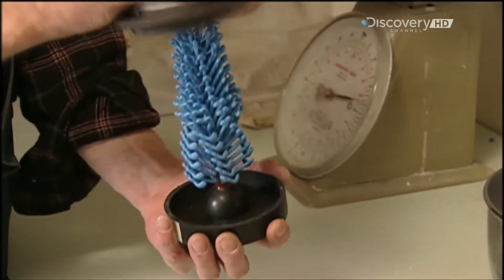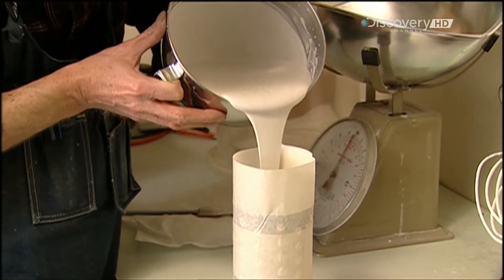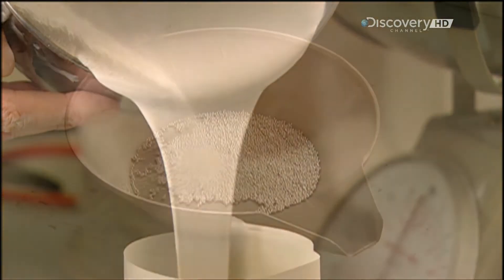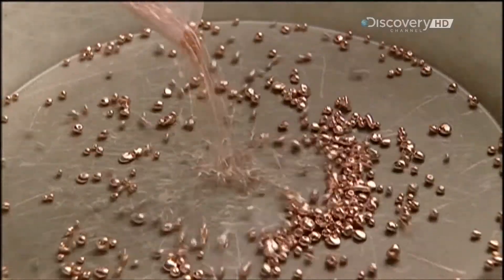Then they place the tree in a perforated steel flask covered in masking tape. They pour in a litre of plaster, which hardens around the tree. The wax melts through the holes, leaving plaster cavities in the shape of the key parts.